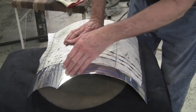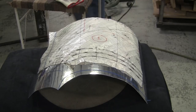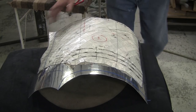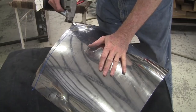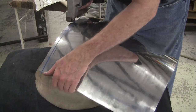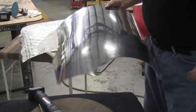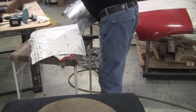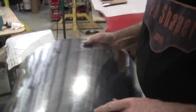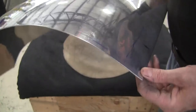You can snap beautiful lines with that blue tape — I use it all the time for cutting. Getting the cordless shear and cutting that little excess off. Taking the tape off — and now with a close-up you can see: there's where the shrinks were, magic marker lines still there, but there's no evidence of those shrinks at all. They've completely disappeared. The malleting marks, the little stretch marks — they've completely disappeared. The panel cleaned up really nicely.